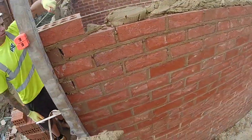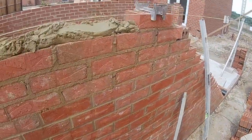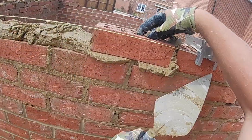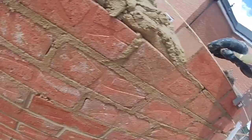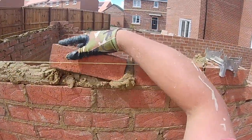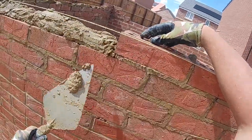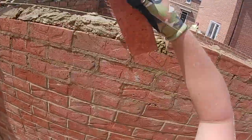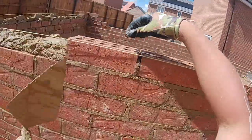In this video I was varying it up between pick and dip and traditional, but I like to say that pick and dip is very fast when you're reaching. It's one of my favourite ways to lay bricks if you're reaching. I did it up these gables when I trestled it, with massive advantages. I really like the feel of it. I feel like you have more time to manoeuvre your brick how you want, get it to the line correctly and check it. I find with traditional, you just don't have that time when you're pressing the brick. You can easily tweak it a little bit more with pick and dip, I find.